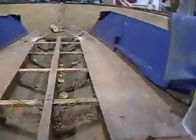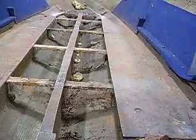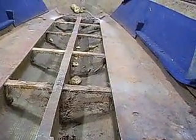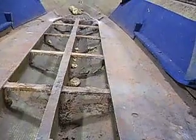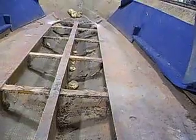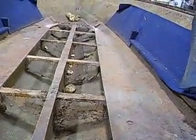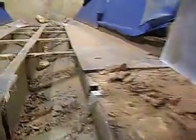because we know it's your dad's boat, and we know, like everybody this day and age, you're on a budget, but we don't see any way around changing the stringers, and that's actually the cheapest way to do it. Now, there's more floor that needs to get cut out.